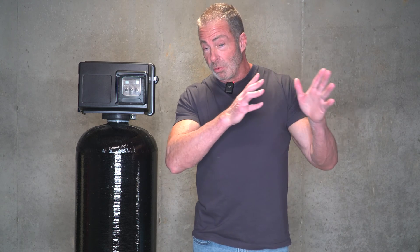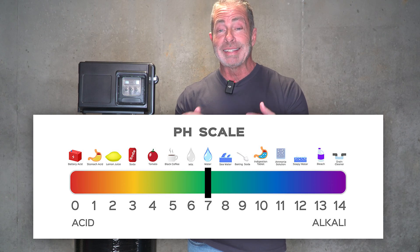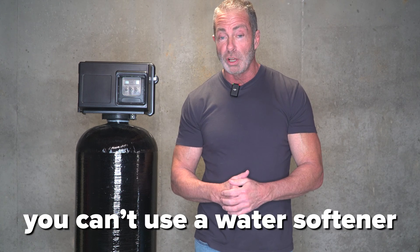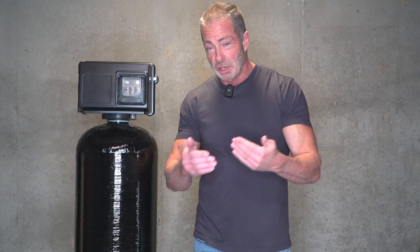Here's one of the big benefits other than amazing iron removal: Catalox Light, the way it's designed, will raise your pH. If your pH is at 6.0, it's going to easily raise it to between 7 and 8, which is where you need to be to correctly remove iron. I can't tell you how many people have called me after someone from Culligan sold them a water softener for 10 parts per million of iron — it worked for a while but then stopped because the pH wasn't balanced. You can't use a water softener to remove iron long-term because iron affects the resin beads, and over time it loses its ability to recharge and remove iron.